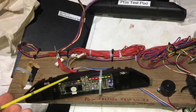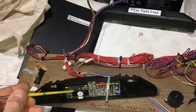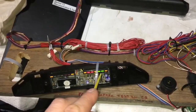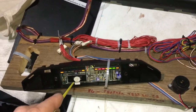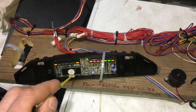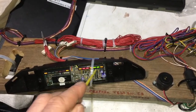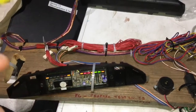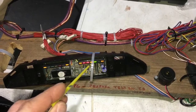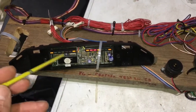You can't really tell this part until you connect it up to a real motor on a C5, but ultimately the ULA has unfortunately been burnt and ruined as well. He's now going to need one of Jeff Wells's ULA replacement chips. In a minute it will start to drop down and then beep. There it is - it will drop down over the space of about the next minute on this camera.